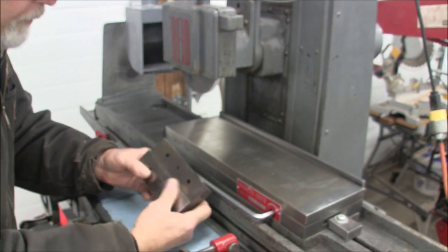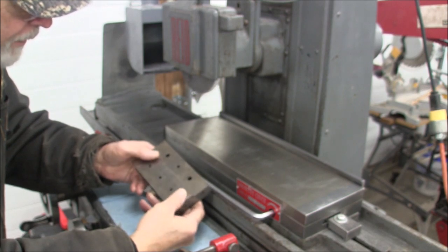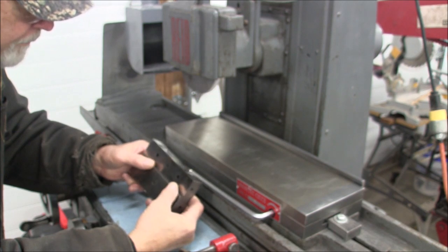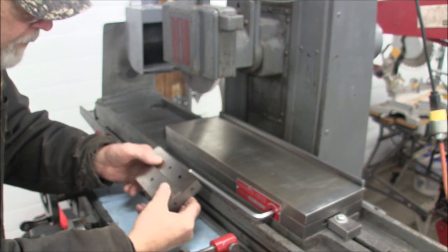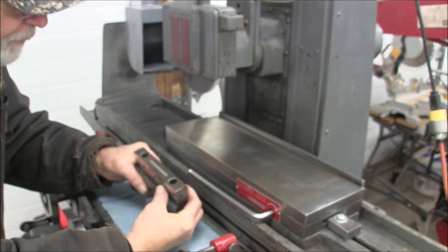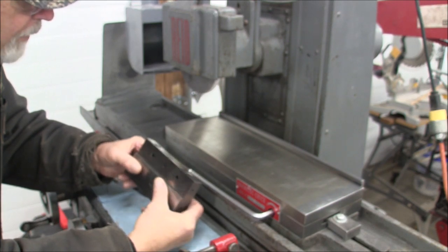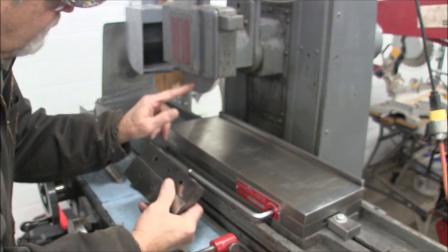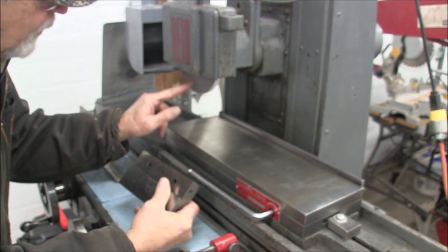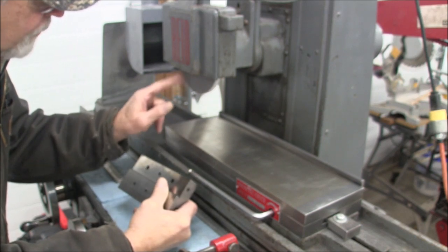And I would like to say one theory I have regarding this whole balance a wheel or not balance a wheel controversy that's going on. I've never been totally convinced that that's really necessary. I guess if you're striving for perfection, maybe. But when you think about it, your wheel is mounted with paper washers between the spindle of the machine and the wheel itself. And there's clearance around the wheel to the spindle too.